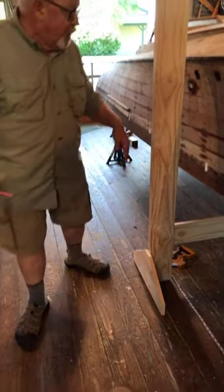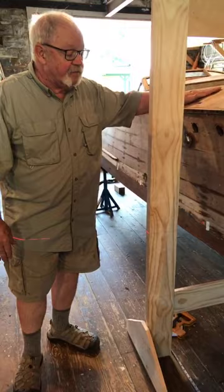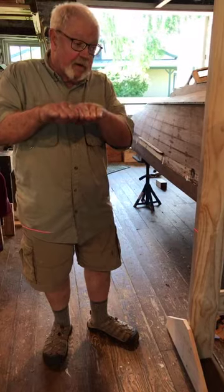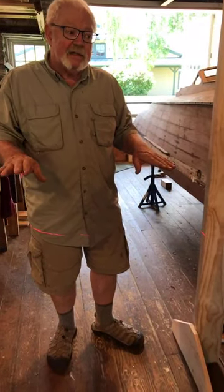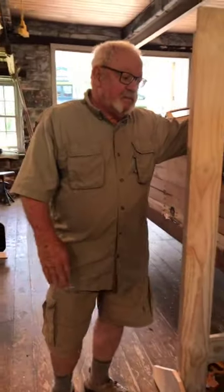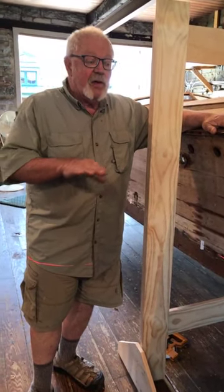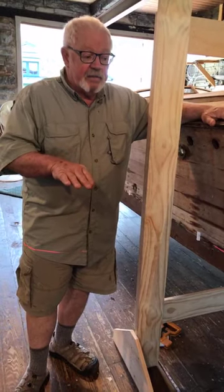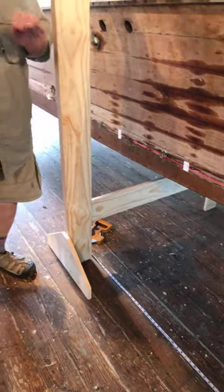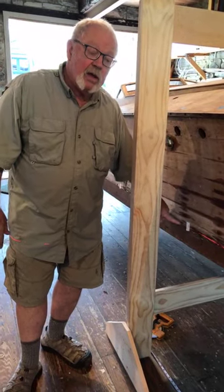So now I've determined that the main stringer's on the inside, and this water line are parallel. One's higher than the other, but they're still parallel. I chose that as the base because boats like this are generally built upside down on the engine stringers. So chances are those were level when construction started. And this is very much in line. It's just a matter of tweaking, raising it here and there, dropping it here and there. It takes a little time, but we decided that this is what we're going to call water level.